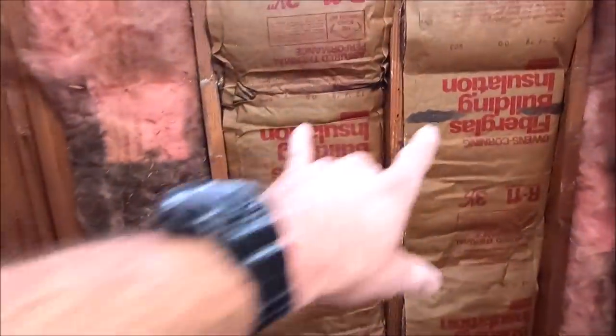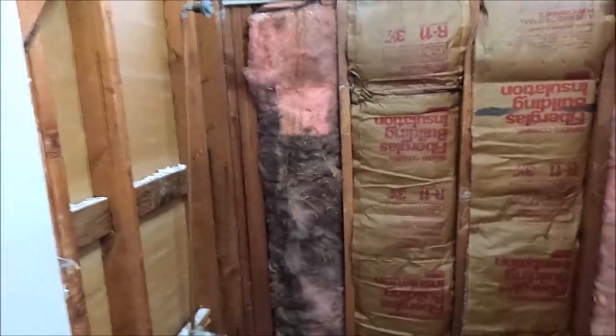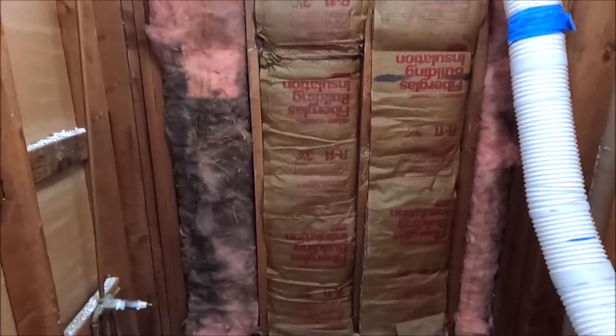So let's get to it. Rough plumbing, rough framing with the niche here, but we need the tub in before we can pull measurements for the niche. Backboard, waterproof, and then we get going with tile. Let's get to work, guys.